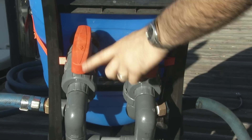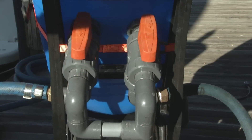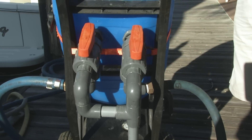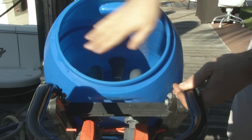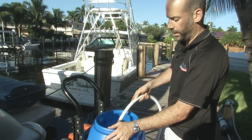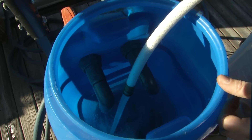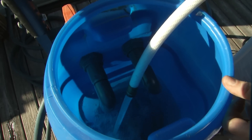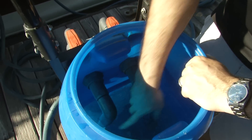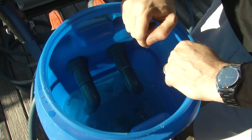Based on the position that we have these valves in, the pump is going to bring the solution up and pump the barnacle buster solution out from this hose through the engine. It will come back through this hose and then come into our tank. You can see here how our system is arranged inside. Now we're ready to start filling the system. We're going to start by filling the bucket with fresh water. Once we have the suction fully covered we can then go ahead and turn the pump on. You can see here now we're getting a return from our system, so we're just going to let it run for a little bit to make sure we've evacuated all of the air from the system.